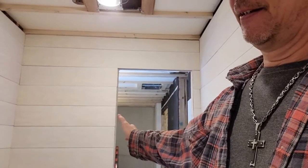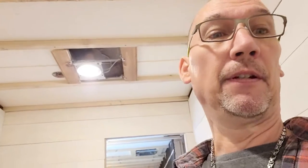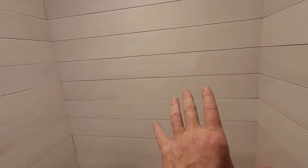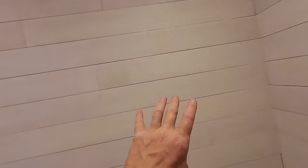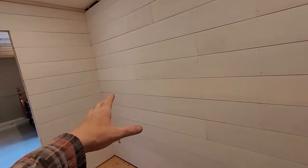What sucks with that, if I would use my noodle a little bit better, and I thought I was. There's so much to think about when you're under. Like I said, I was going to order 12 footers of shiplap originally before the pricing went up. And that's probably what blew everything on me. Here's what I'm trying to get at. If I order 12 footers, this wall was 70 inches. I get 2 boards out of a 12 footer. Why would I buy 12 footers for this wall? It would have been just one piece all the way across. I would have had a 2-foot waste. I could have got 10 footers too.